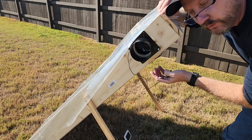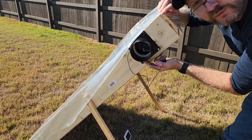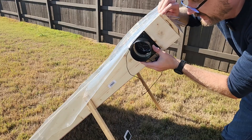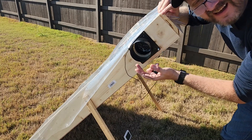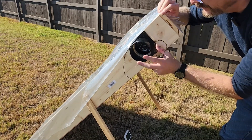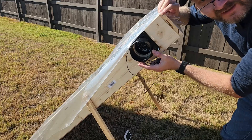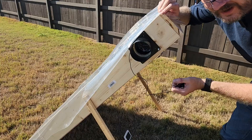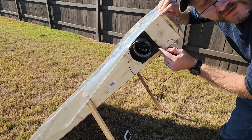One of my little secret weapons here is this 120 millimeter fan to four inch dryer vent adapter. These are made for grow rooms, so this really makes adapting to four inch vent pipe really easy. It'll let me just drop a fan right on with some really small bolts.